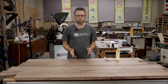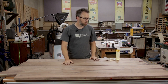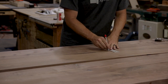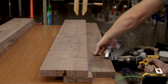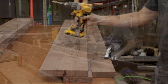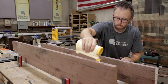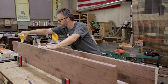I've spared everyone a lot of the wood milling processes. I've processed most of this walnut into clean boards, glued them together in smaller subsections, and now I'm ready to get those subsections glued together into what will be side A and side B — we'll have the two big sections with the steel running down the middle. I drilled the dowel holes just for alignment on the top, which helped with some sanding afterwards, so I'm ready to get those in the holes, get some glue on here, and get it in clamps.